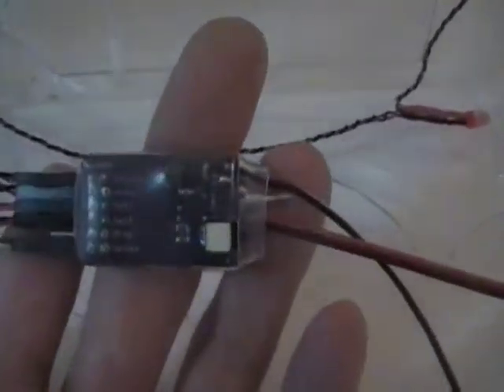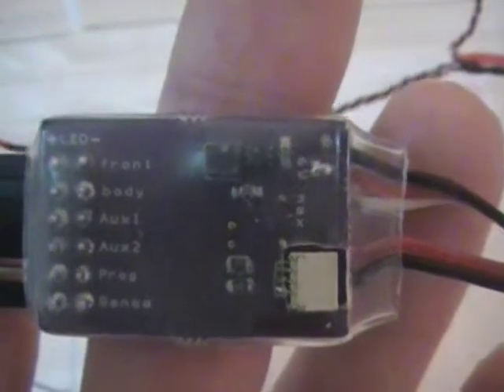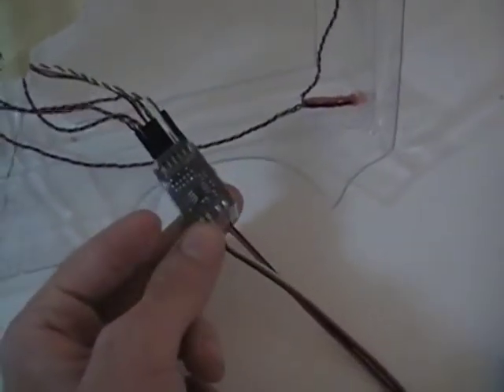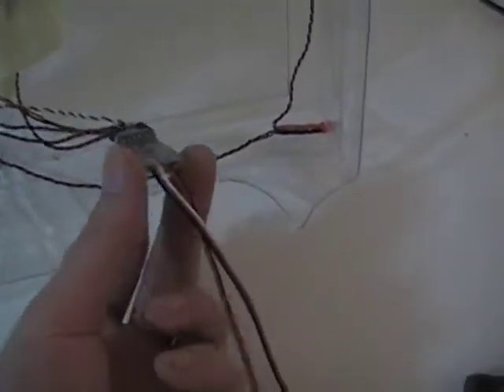It's a pretty small board, and this is the second set I've made. It uses a tiny two millimetre square switching regulator — at the top left you've got the inductor, which is bigger than the regulator, and to the right of that is the regulator itself. The first board used a standard linear regulator, and dropping six volts down to the required level with the full current load from all the lights meant it actually got quite warm. This regulator can handle an amp with no problems, and so far I've got it pulling just over 600 milliamps and it doesn't even break a sweat — impressive considering how difficult it was to solder and get the solder paste placed precisely.